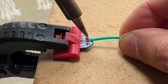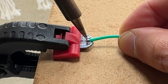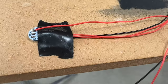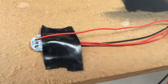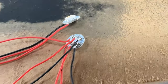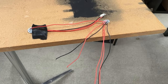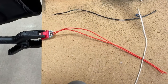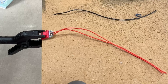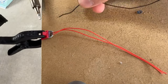Attach the middle data wire first — if that is slightly off, you can adjust it without disturbing anything around it. If you make a mistake, simply desolder and try again. For NeoPixels with six wires, it makes more sense to solder the bottom set of wires before the top. This is also drawn in the diagram, but it is still easy to mix things up, so double check your work. Most issues were solved by re-tinning the soldering iron tip — this was the only way I could get wires attached to the pads. If in doubt, re-tin the tip before every step.